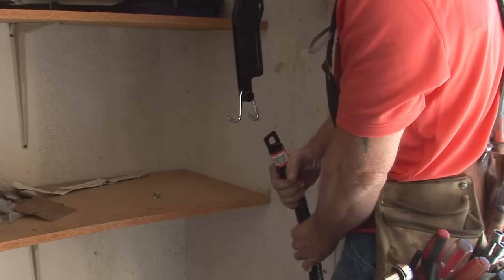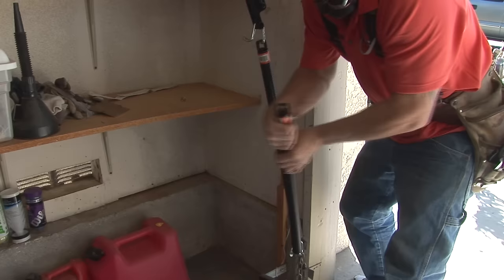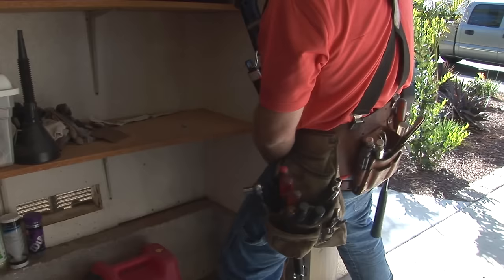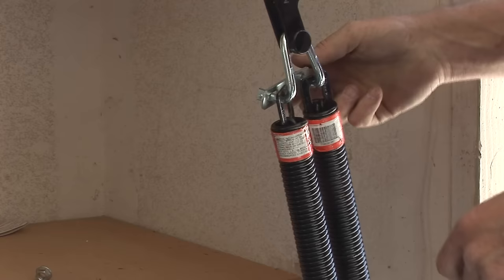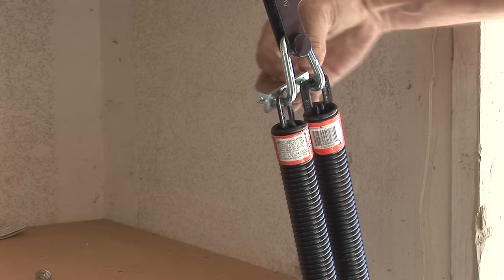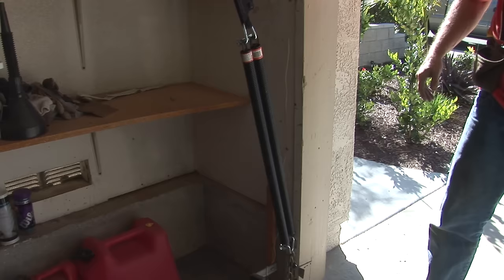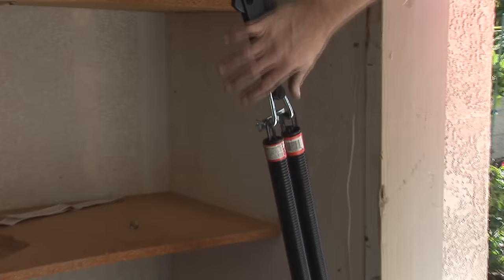It's the same principle as when you take them off — just dip at the knees, stand up, put it on the hook. I don't want my springs sticking out into the jamb either — I want them basically in. I can pull it in that way which will assist in keeping everything lined up straight down. Put the clip on to lock it into place. All of that can be easily and quickly removed if I need to readjust or rebalance. Nice clean straight line all the way up — nothing to hang yourself up on, no sharp edges.